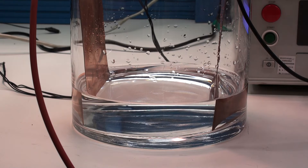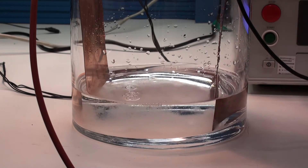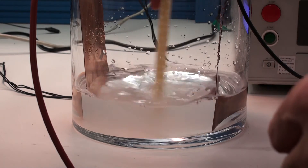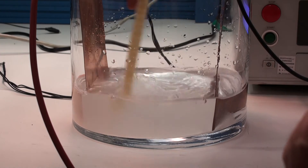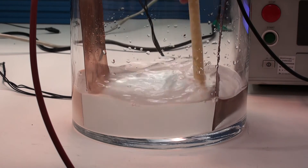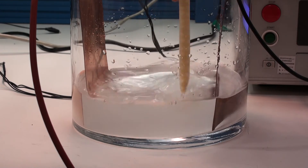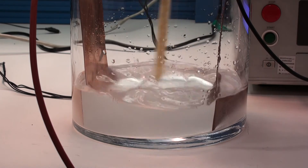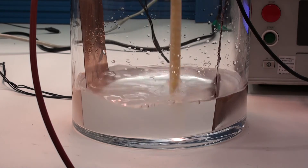In this clip, we're getting ready to add 10 grams of SAP. This is what in the previous experiment would take and jellify within about 40 to 50 seconds. So that's what we're going to do here — get a resistance reading of what the SAP is, because just the water itself was definitely pretty low at 138 kilohms — and we're going to allow this to jellify and then see what we get.